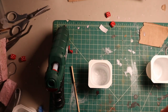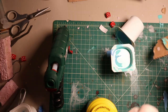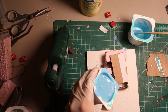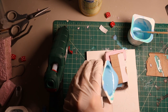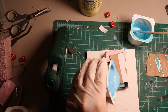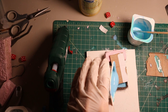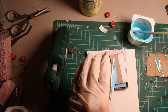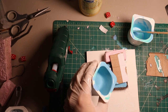Using my trusty custard pots, I mixed up a larger batch of silicone. I estimated that about one full pot would be enough. I noticed that the blue component was a bit separated — I didn't really think this was a problem, but I made a note of it. I mixed up the two parts, stirred them for the recommended 2-3 minutes, then began to pour. According to the guides, you should pour from a bit high to the lowest point of the mold and allow the silicone to slowly fill the box. Unfortunately I made too much silicone, so that was wasted. I also noticed some bubbles, which I wasn't happy about — usually at this point a vacuum chamber is used to degas the rubber, but of course I didn't have that. In the end the mold was filled and there was nothing to do but wait.